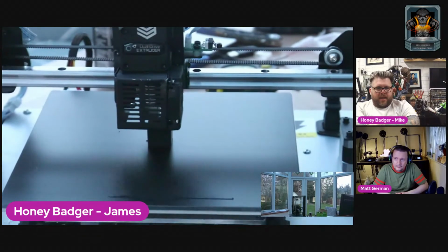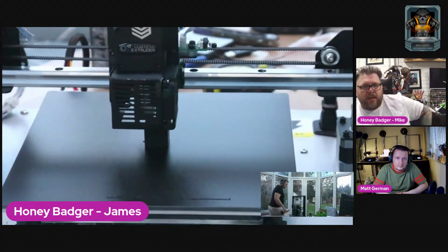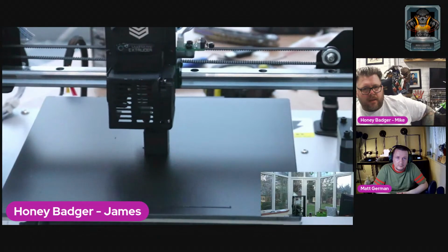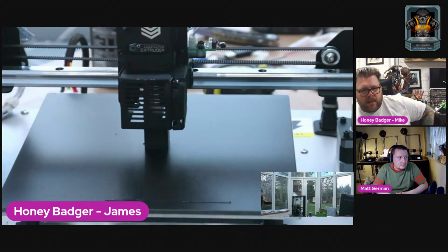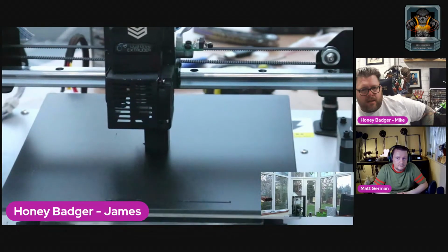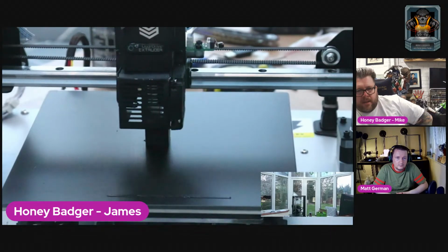All right, let's turn that light back on. And I mean, that is rocketing along. I'm pretty happy with that. All joking aside, some of the issues that we found, the first lot of issues, the bent lead screw, the belt that's not tight, they're all issues that have been caused in shipping. They're not the printer's fault. They're not the manufacturer's fault. They're just shipping. That box has been kicked about.